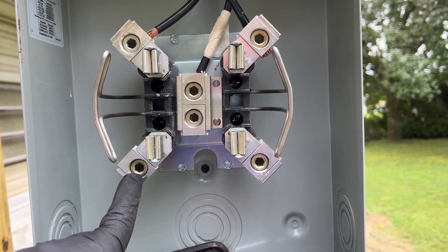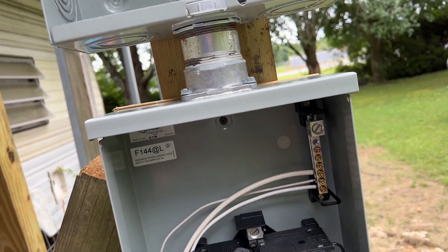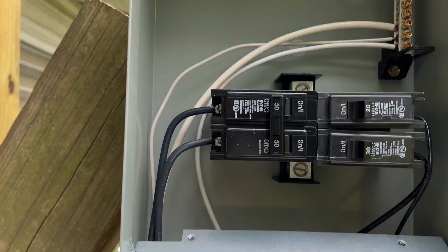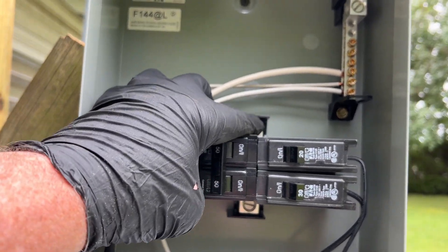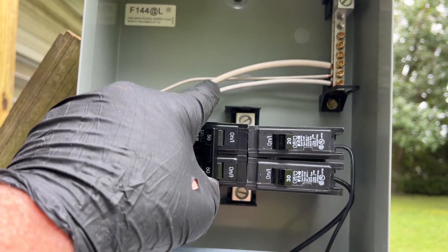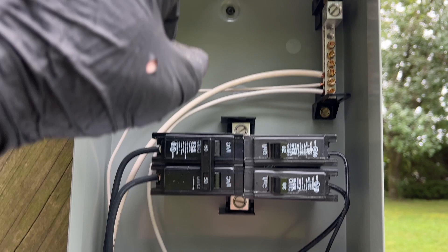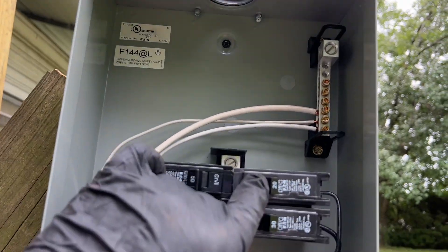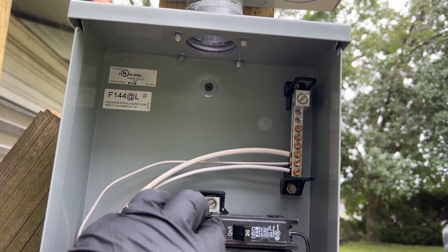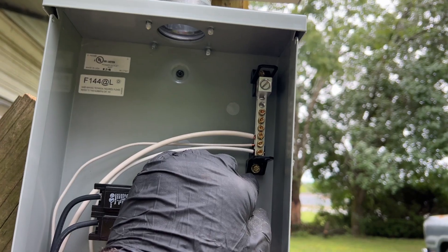This one here I will go all the way down, go through here, and I can pick either this one or that one. I'll probably come down to the one on the left and do this, and come down on the one on the right and tie it to this one. The center tap of the transformer will go right there for the neutral.